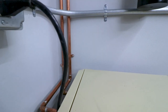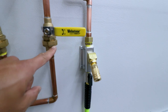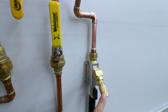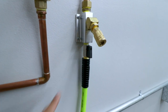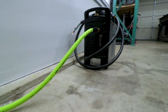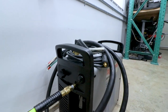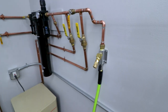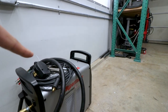Once the air is dried it comes back up, and then we open up the valve and over down, and there's an air coupler so I can split off to a quarter reel if needed. But there's also another valve that goes all the way down, and this is the primary reason this setup is here — to feed it down and into the back of my Hypertherm PowerMax 65. This is my plasma cutter for my CNC plasma table. So the whole purpose is using the air filter and air dryer to deliver clean dry air for this plasma cutter.